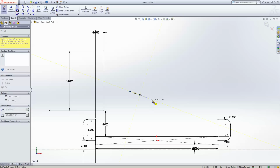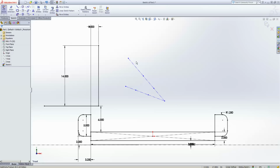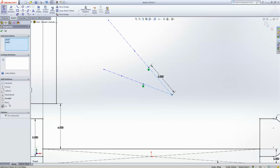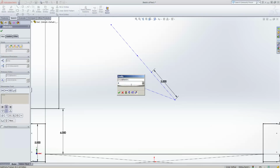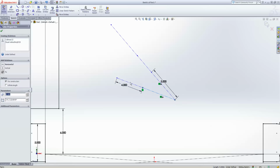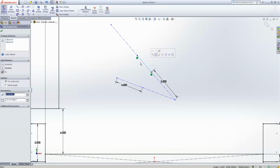If you look within a line of cylinders, there are essentially a couple of base numbers. The cylinder, even with 0 stroke, has some length, and that includes your clevis length. Let's say we're doing 3/4 bore cylinders. I'll call that nominally 5 inches. This is the length of the cylinder that happens no matter what, regardless of stroke. Then the body of the cylinder gets longer per each inch of stroke because you need that room. Let's say we're dealing with a 4-inch stroke cylinder now. That's retracted, so you have the retracted body of the cylinder plus the stroke length. If you don't believe me, maybe I'll do a video just on using the Bimba catalog, because that can be kind of tedious.